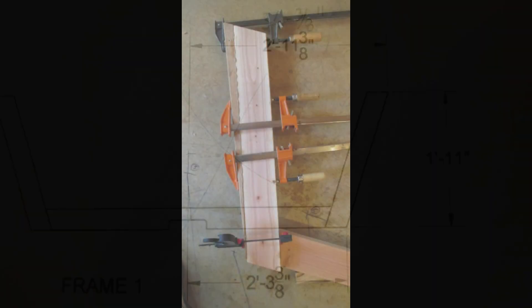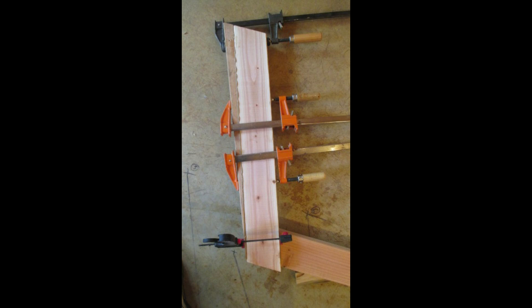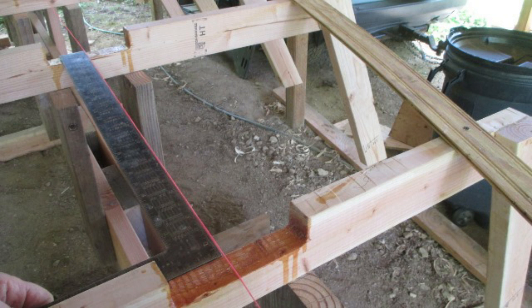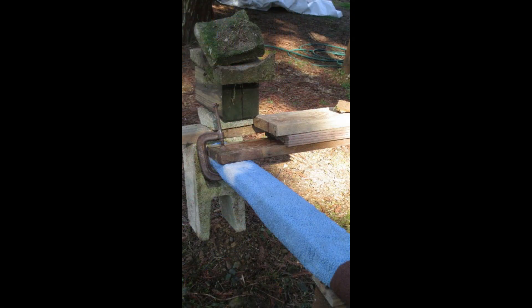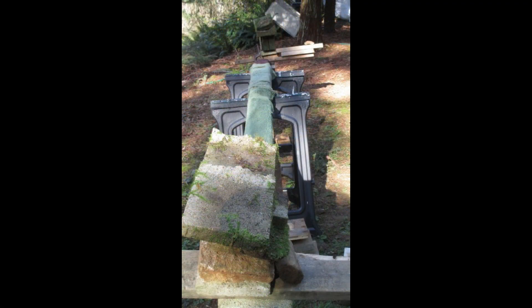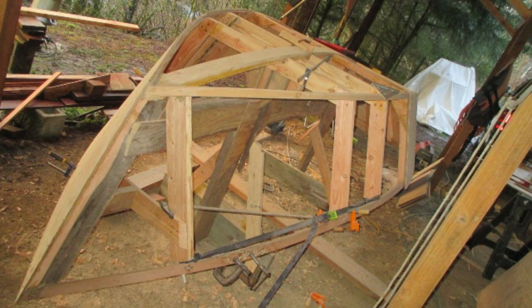I didn't like the way it would look. Rather than build a new frame, I ripped two wedges from a scrap of 2x2 the length of the frame's side members. The wedges tapered from a point at the bottom to one inch wide at the top. I glued them to the outside of the frame, and to my eye that looked better. I ripped corresponding wedges off the insides of the frame. I used a rasp to bevel the notches in the forward frames to match the angle of the upsweeping keelson. I checked frames for square to centerline and tacked on long strips of thin plywood to hold them in position while I glued and screwed the keelson to them. The drift boat called for a 2x4, but I could not get a 2x4 to bend far enough to the required curve. Instead, I fastened a 1x4 to the frames and then glued and screwed another 1x4 on top of it.